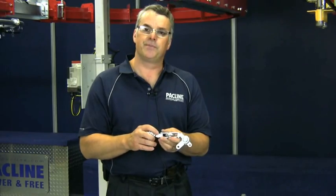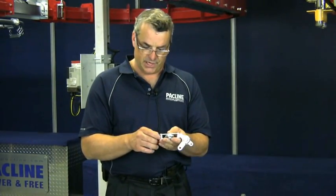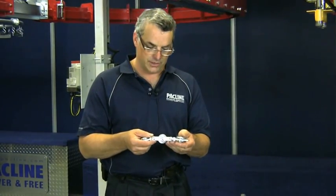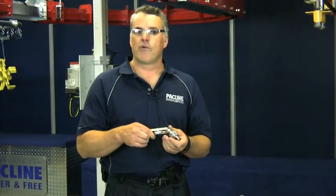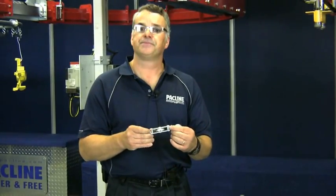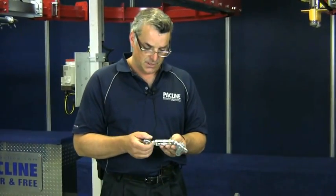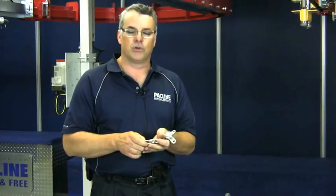That's a sign of either overloading or lack of lubrication. The same holds true for the pins. If the pins aren't lubricated, of course they're going to wear. And when they wear, the chain will get longer and longer. In each foot of chain, you have about four of these chain pins. And even though they're only wearing about five or six thousandths of an inch, over the length of a thousand-foot long conveyor, that can add up to a significant amount of inches. Eventually they'll get to the point where they can no longer be pulled through a drive unit.